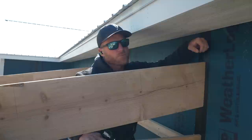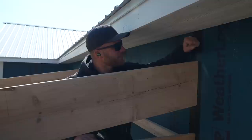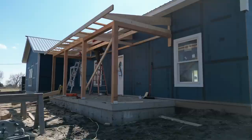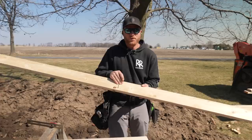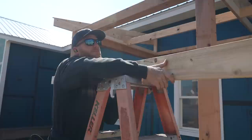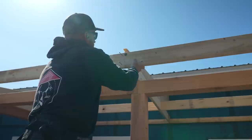During the framing stage, all of these post locations behind this wall are specific to the design of the post locations on the porch, and everything lines up so that bearing points are always transferred to a post. Right behind here is a solid post with blocking all the way on, so when we fasten we're going into something solid. Now we can put a 2x12 hanger here and go into something solid. Especially when working by yourself, as much work as you can do on the ground the better. I've got all my fascia marked and screws already placed.